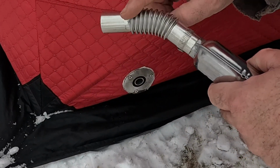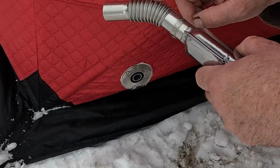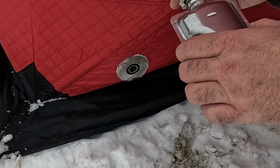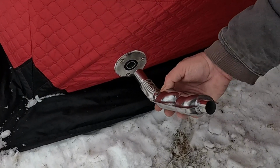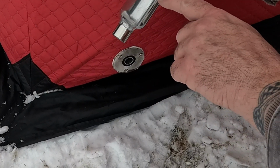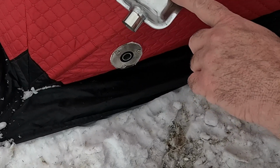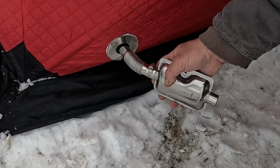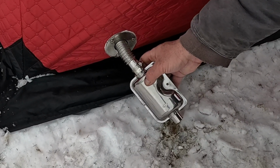This is another one of those 90 degrees like I used on the bottom of the heater. So I bought a 2-pack of these. Like I said, all the links down below in the description. There's a small weep hole in this muffler for any condensation, so that should be pointing down or trying to sort of point down.